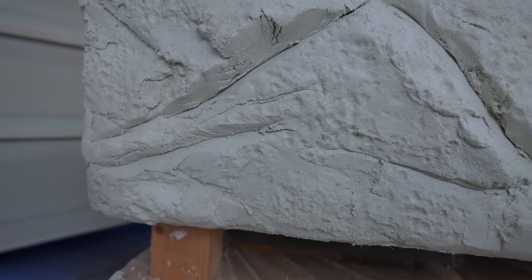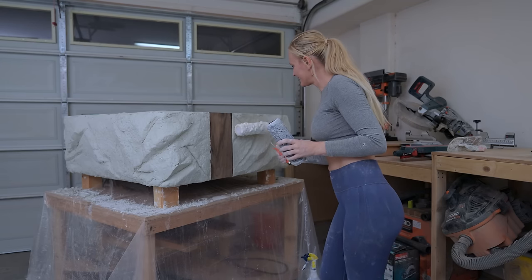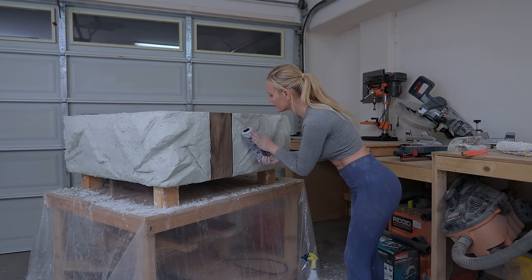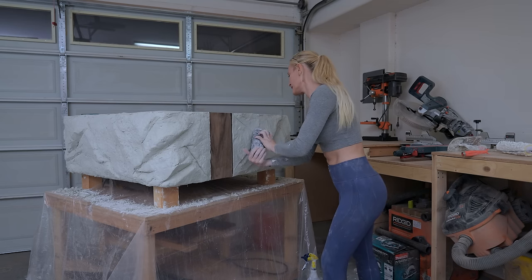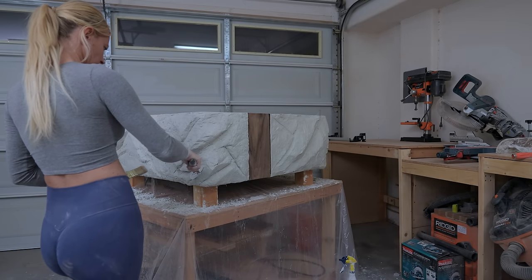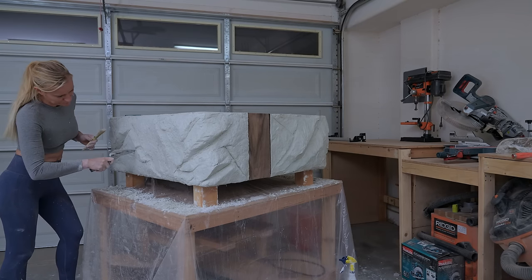One I purchased off Amazon, the other one I made myself using instructions provided in one of Warren Ness's videos. Let the concrete dry for a few hours before using the pattern rollers, so the concrete will keep the pattern shape. Once you've got a nice pattern print, let the concrete dry just enough so you can chip off larger pieces to make the rock look natural. It cannot be too wet so the concrete won't break off, and it cannot be too hard so the concrete won't break off anymore. So keep checking throughout the drying process.